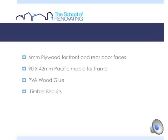Okay, so you'll need some 6mm plywood for the faces of the door. Just want to stress that it should be joinery grade plywood, so you have a nice smooth surface to finish. The framework's made from hardwood. We use 90 by 42 dressed all round Pacific maple, but that's really up to you.